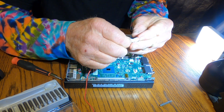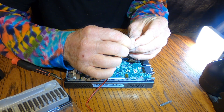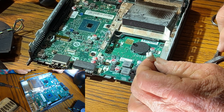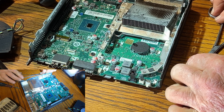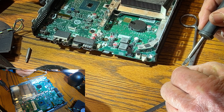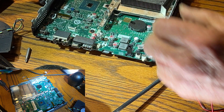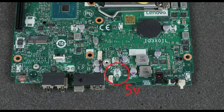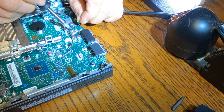If this doesn't work out, I'll just cut that connector off and solder it straight to the motherboard. I've had to bend the legs a little bit and shorten them up a touch. Now I need to add a little bit of fresh juicy solder to those legs — I've got the wrong tip on here. I want to add some solder to the pads too. There's a little bit on there but that's old. Here's the motherboard location we're soldering to — it's labeled positive and negative. I want the fresh juicy lead-based solder on there.